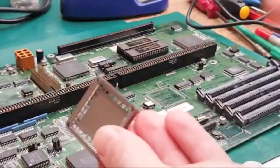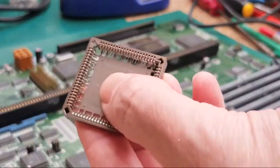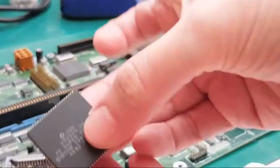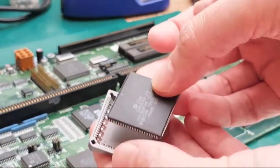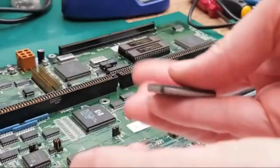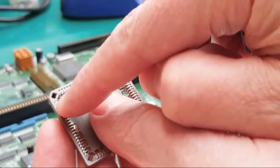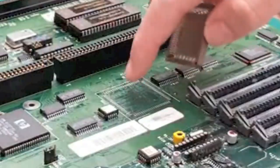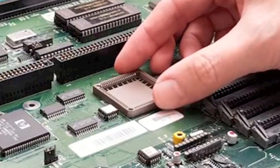The first thing we need to do is work out which way to fit this socket. If you look at the socket super closely, you can see that little arrow — that's the pin 1 mark. Carefully comparing it to the chip, we've got a dot there — that's pin 1 — so it will go like that into the socket. You can also see it's got a chamfered edge here, the edge is shaved off on one corner, and you'll typically get that same gap shaved off in the socket as well. So we know that pin 1 is marked here on the board in white silkscreen, and it needs to go in like that.